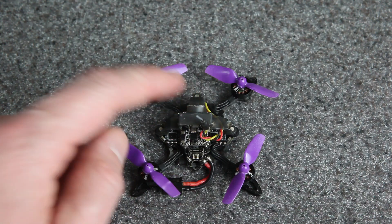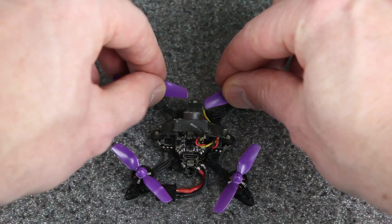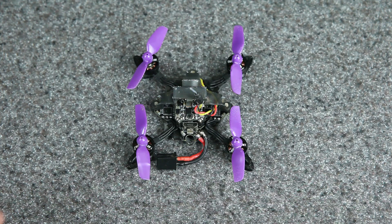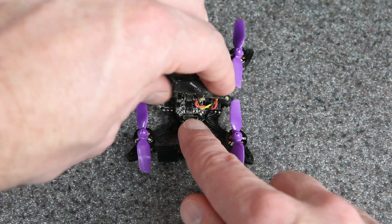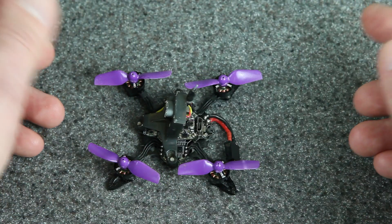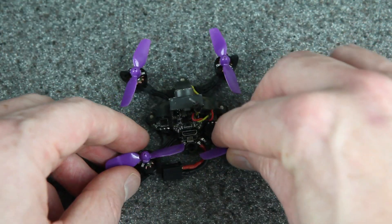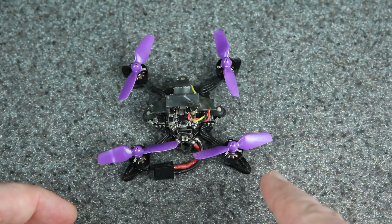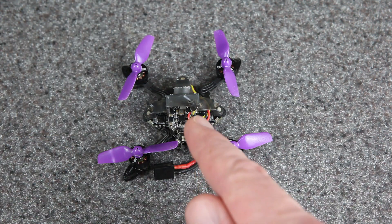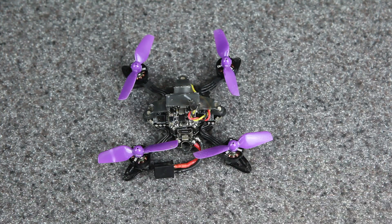This is the front of the drone up here, and I like to fly with reverse motor orientation or props out, which means these two props spin out away from the camera. These back props spin away from the back of the drone, but this didn't used to be the back of the drone. Recall that the USB used to be on the side, so this was the front. Originally I had this set up props out, with this one spinning clockwise then counterclockwise. So all of the motors are going to have to reverse orientation. We're also going to have to remap them because they're in different places, and we're going to have to tell the flight control firmware that the gyro has been rotated as well.